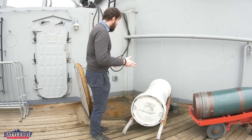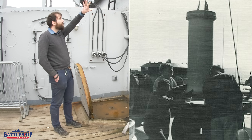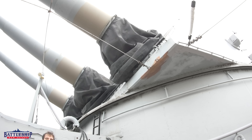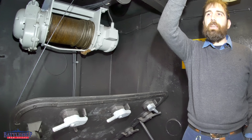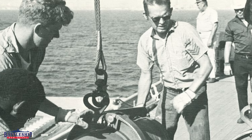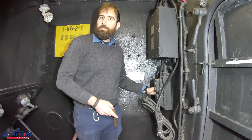Once you have the bags on board, they're brought to a hatch like this one. Turret one only has two of these hatches because of how narrow the ship is, but turrets two and three each have four. Some hatches are for shells, some are for powder. When you open this up you rotate the turret a little bit, and on top of each turret is a crane that folds out over the side. The crane is just a mounting point for a wire — this wire runs from an electric hoist up to the gun turret and then down the hatch with the powder. There's a special grab-claw-type attachment for the powder canisters and shells for lowering them. Each hoist has a control box with up and down switches.